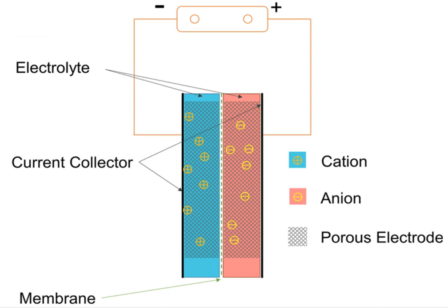According to IEC/EN 62391-2, capacitance reductions of over 30% or internal resistance exceeding 4 times its data sheet specifications are considered wear-out failures, implying that the component has reached end of life. The capacitors are operable, but with reduced capabilities.